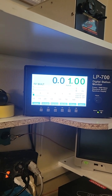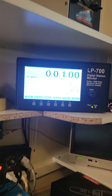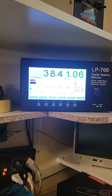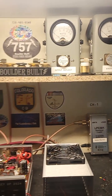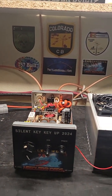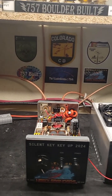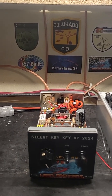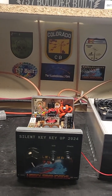There's a one-and-a-half watt dead key and that gives us just about 40 watts out, which is about the max dead key you really want to run with this. People run more than that — do as you will — but this is just my recommendation. With that 40-watt dead key, let's see what we're modulating here.